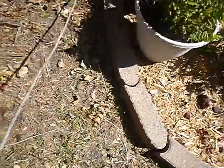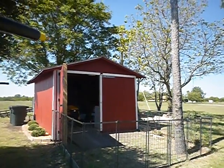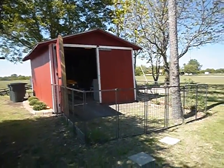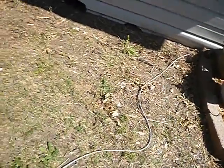And what we have here is a little outside of even that. It looks like we've got an extension cord, which is a trip hazard, routed to the portable shed, which is beyond the scope of this inspection. They have a little window unit in there. They have a drop light in there. So that's something else right there. So they're really kind of taxing this bootleg circuit that was improperly installed. But that's not why we're here.